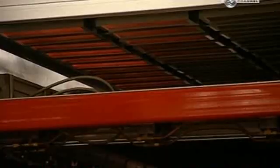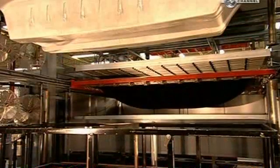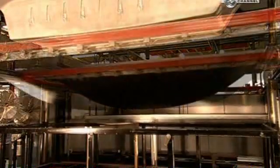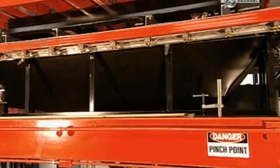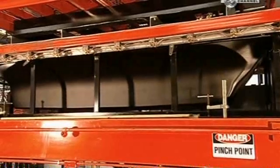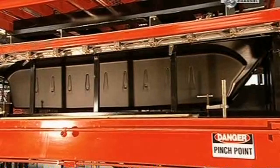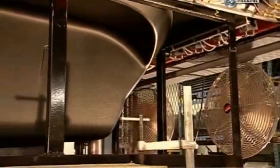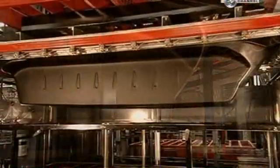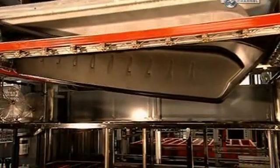To make the vehicle's lower body, a sheet of polyethylene is heated in an oven. After four and a half minutes at 232 degrees Celsius, the sheet emerges softened by the heat. An aluminium mould drops down and a vacuum-forming machine stretches the plastic around it, sucking out air from between the two. After the plastic cools for four and a half minutes, the machine lifts the mould, leaving a cavity about the size of a large bathtub.